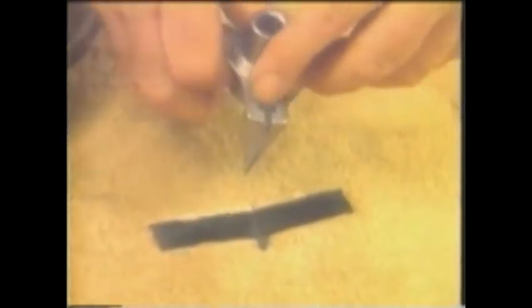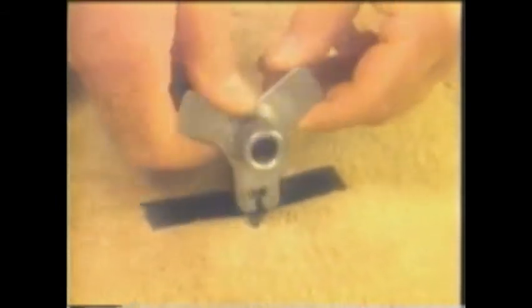We'll insert the screw bit. And it's down through. Pull that away. As you can see, the screw has not gone directly into the carpet, but it has stayed up high enough where I can now use the screw removing device on the accessory. Screw removing device, screw head — simply slide it over, move it back and forth until you break it off, pulling it out. Now you can see there's the tape — pull the tape away. There's where it broke off.